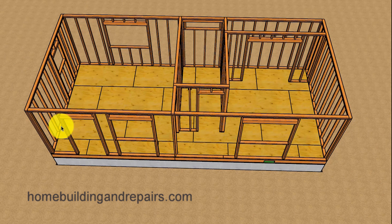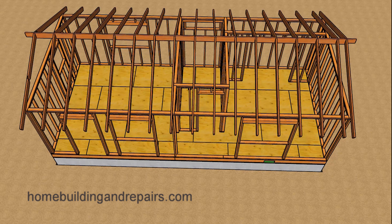The thing that sticks out most about this particular project is the fact that they had large spans. If my memory is correct they had at least two six-foot sections without any wall framing studs. I don't remember any wall framing studs underneath the window sills or above the window or door headers, and there weren't any sags at all in the framing plates.